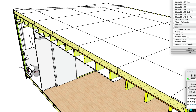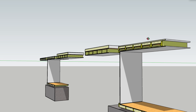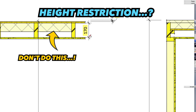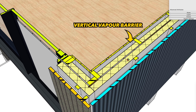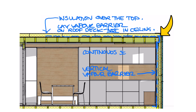For this roof I'm going for a warm roof — as you should always if you can — with the insulation laid on top of the deck. But I'm also going to give you the right solution if you're stuck with keeping the roof beneath a certain height, perhaps for planning permission or permitted development reasons and your 2.5 meter rule. First, get the position of your vapour barrier right and ensure that this horizontal barrier laps into and creates a seal with your vertical vapour barrier. We're focusing here on making our rubber membrane and our roof deck last forever.